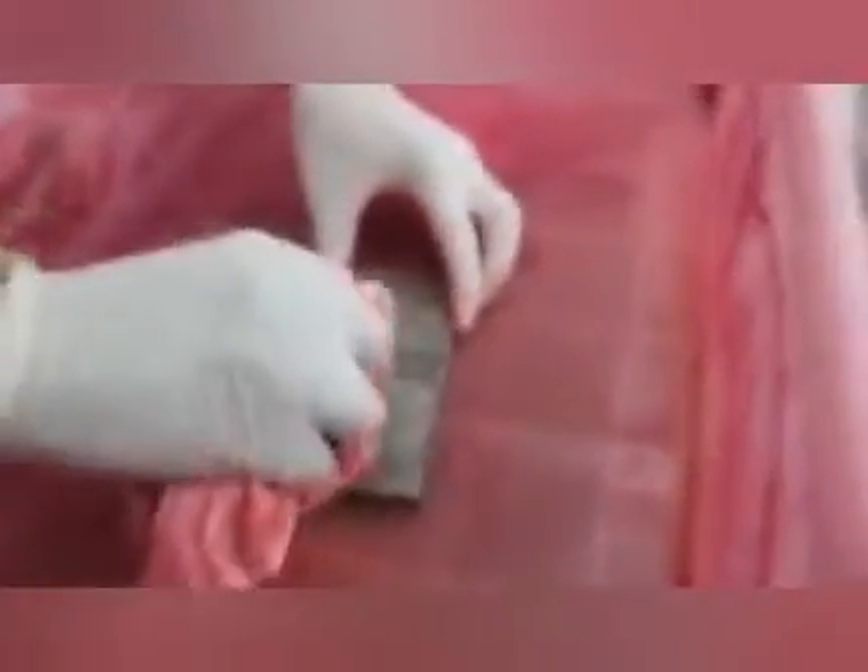The advantages and disadvantages of the water washable technique: it has a lower cost, no emulsifier is needed, fewer processing steps, and process time is reduced. However, its disadvantages include that there is no control over the diffusion or emulsified layer. Post cleaning follows.